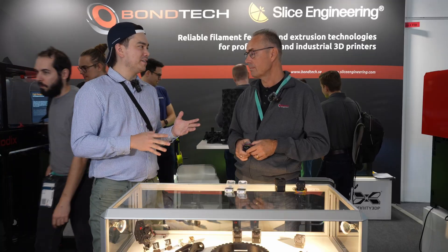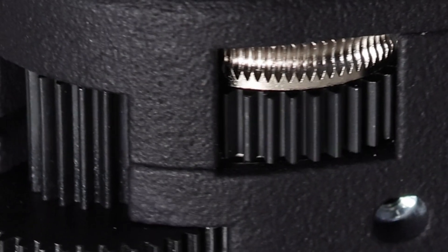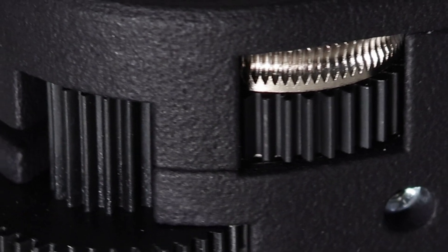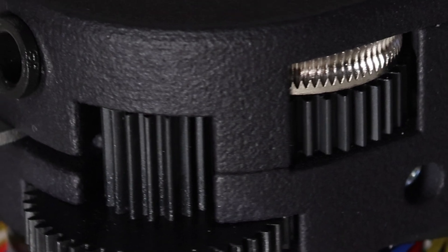When you 3D print parts, they have a matte surface finish which looks nice, but it can cause issues with tolerances because that surface is a little bumpy. What kind of post-processing do you have to do? Post-processing the SLS product, we use media blasting to remove the residual powder, but also for the critical dimensions, we machine it, we ream it, and then we inspect it.